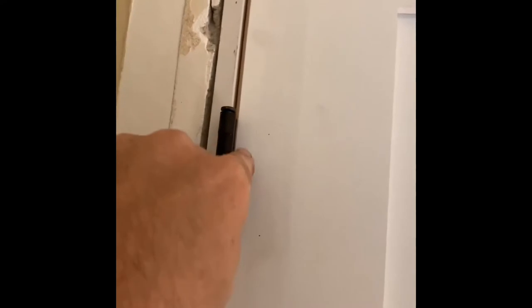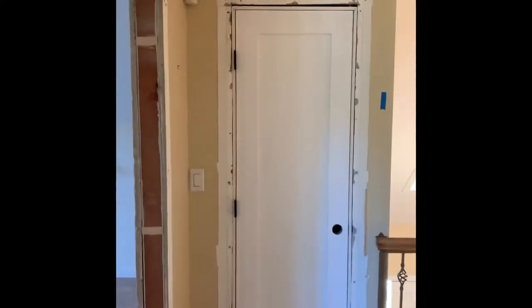And then the amount that the hinge was overlapped, I used my knuckle bender and I brought them into alignment, put the pin in, pulled it, and the door did not bind anymore. So, you know, there's a lot of moving parts when you're hanging doors. The knuckle bender is something I would have on hand when you're in the process of installing.